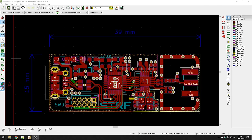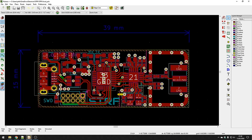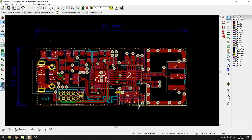Before we can start routing, we need to look at the layer stackup. In general, for anything RF, you want at least four layers — two-layer boards will mean your controlled impedance traces will be very wide, and you'll have problems with decoupling and power planes. I generally stick with a four-layer board. We have front copper for signals, the inner copper layer as ground, the second inner copper layer as power or 3.3V, and the lower copper layer for signal. PCB thickness is 1.6mm.